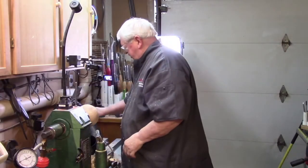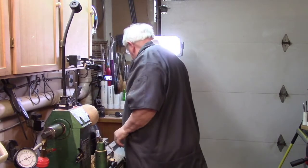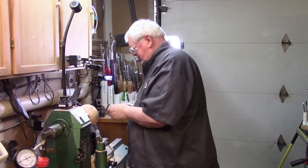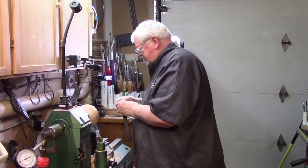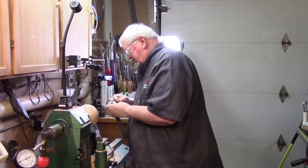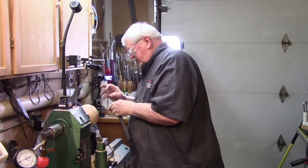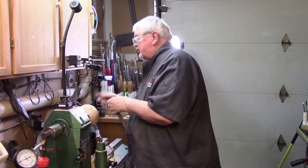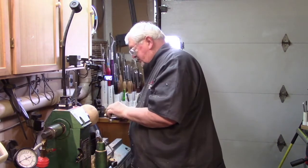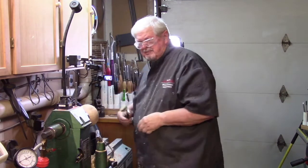I've opened up my dust collection port, brought my hose right up underneath the bowl, and I'm going to use a reciprocal sander here, one of these guys with Velcro on it. It has a Velcro pad and a secondary pad, the purpose of which is to keep this one from breaking down. As heat generates, the little hooks on the Velcro will fail. I can throw the intermediate away, save my main unit, and then simply put another short, inexpensive pad back on. Easy to do.